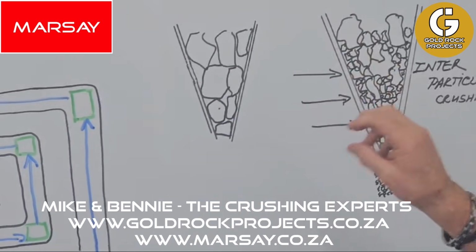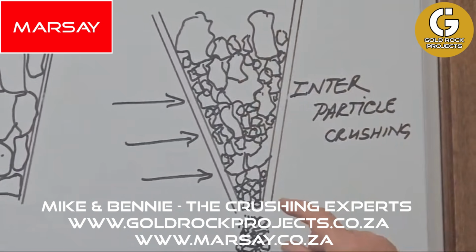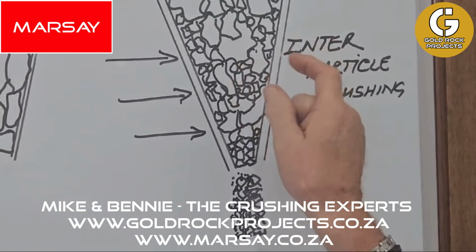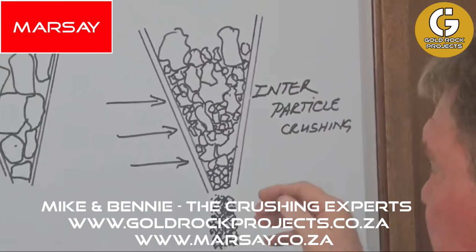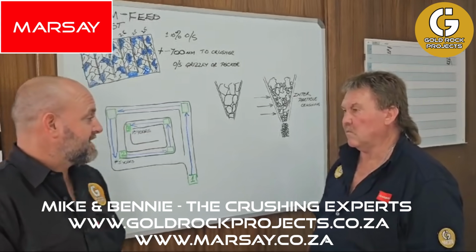Where you have a graded material, like your blasted material, it's fragmented, it reports to your jaw crusher with all variable sizes in the jaw. And the crusher doesn't just crush on the sides, it's material on material on material. That is where your rock gets reduced, and that is how you generate your fines and the smaller particles. So that's obviously what you refer to as interparticle crushing.